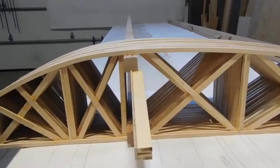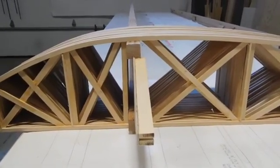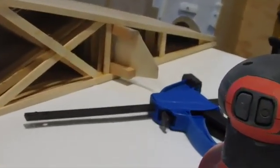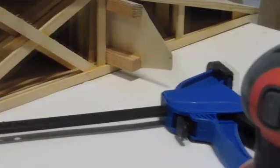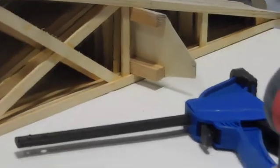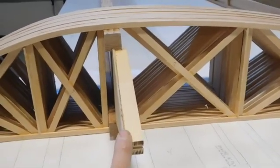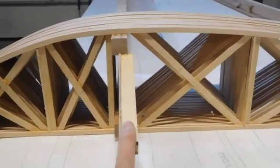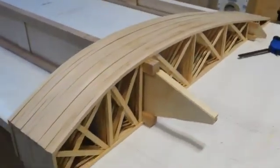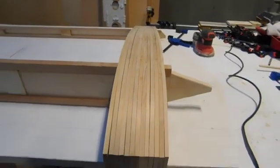So all the ribs fit right through, and that's why that main spar spacing when you do the jigs is so important for those wing ribs. And that's the same for the back spar. That one spacer right there, that one upright, sets the spot where that main spar will fit into. So that back one and that front one have to be in the exact right spot so the spars will fit through, and you can glue the ribs right to the spar, right where they're supposed to be, and everything fits hunky-dory. You can see all these ones fit on there just right. So now we'll just separate those ones and then bring in the false spars and put them in between.